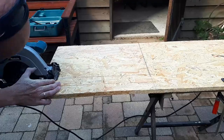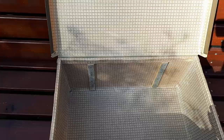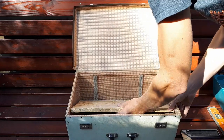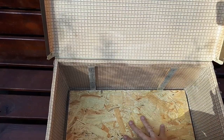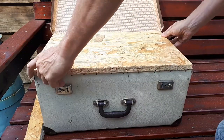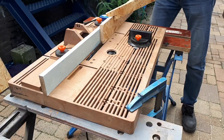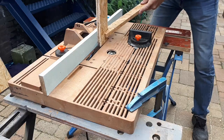I started construction by creating a box inside the suitcase, which serves as a decent speaker cabinet. The first panel was the back of the cabinet, which of course had to fit through the opening of the suitcase. I created two backing strips for the panel because I thought the plate would not fit in the round edges of the suitcase. However, the panel fit perfectly against the suitcase bottom. Next, I created the top plate that will be used to mount the speakers. After creating the rectangular plate, I found out that it was too thick to fit under the suitcase lid, so I decided to create a recess along the perimeter of the panel to sink it partially into the suitcase.